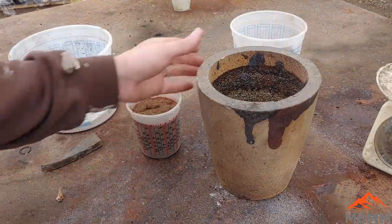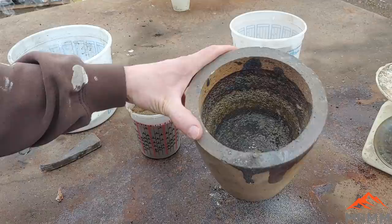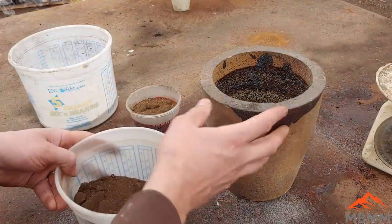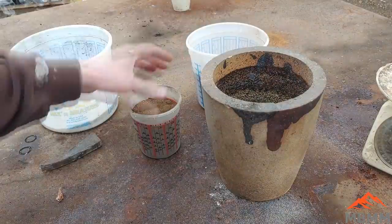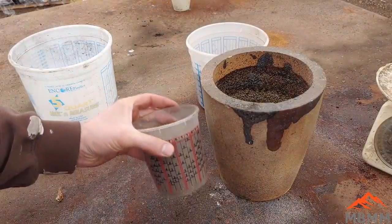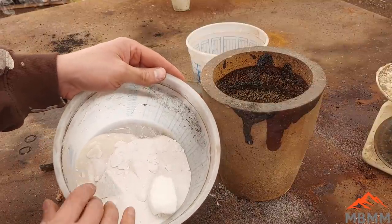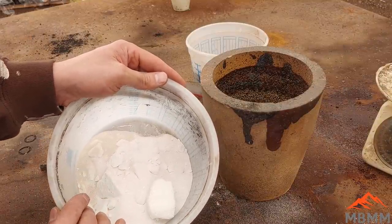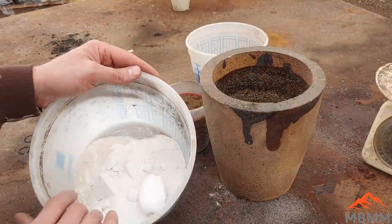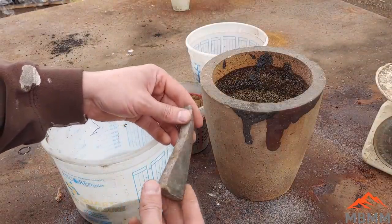The other thing I've been trying to figure out over the years is the best kind of production smelting method. And so today, I can't fit all of these concentrates in this crucible and smelt them all at once. So we're going to do kind of a production smelting process where I'm going to take 1 kilogram of concentrates. This is 800 grams of soda ash and 200 grams of silica sand. We're going to mix these up, put them in a crucible like this, and smelt them down in the furnace at about 2,000 degrees Fahrenheit or about 1,100 degrees Celsius.